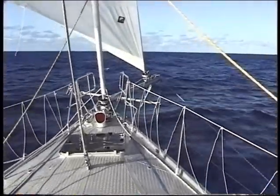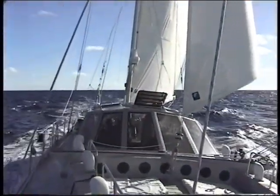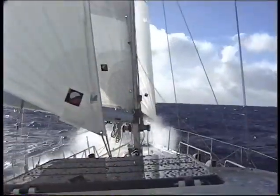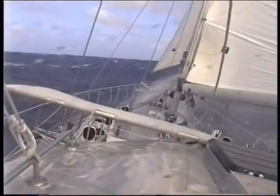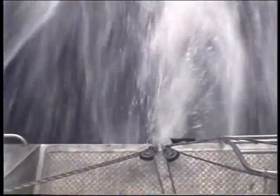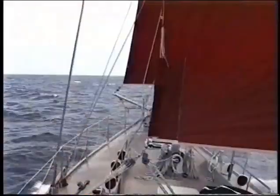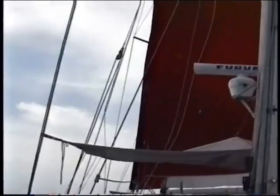Off the wind, a roller furling reacher is set on the bowsprit, while a roller furler jib is set ahead of the mizzen. This easy-to-handle combination really gets the boat moving. Yet one or both of the sails are quickly rolled up if the breeze goes forward or kicks up. In lighter winds and when sailing at really deep downwind angles, an asymmetric spinnaker is easy and fun to fly. The mizzen chute brings the performance up another notch, and being all inboard can be left up in strong winds.